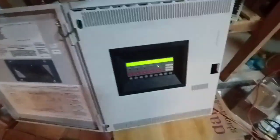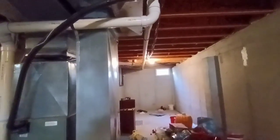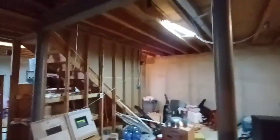That True Alert and the 4903 will be on march time, that strobe will be on code three, and the SmartSync will be pulsing that True Alert to temporal coding as well. I didn't go in and change it because for those familiar with these Simplex True Alerts, the SmartSync models — the 120 beat-per-minute march time doesn't work on this. The march time is a little different, I think it's 60 beats per minute, whereas these you have an option between 20 and 120. So we'll go ahead and start off with the smoke.